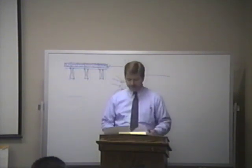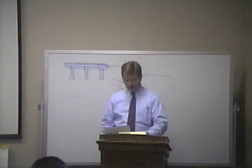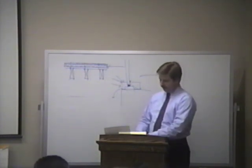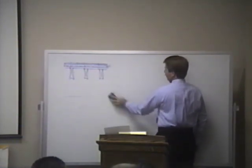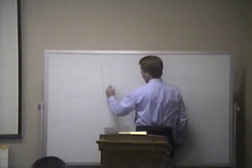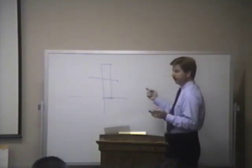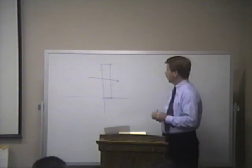Infiltration, next subject, and that's a big impact on houses. It's an impact on commercial. On page 79, it says a typical new building's infiltration comprises a range of about 10 to 20% of the total heating and cooling. And basically, I'll let Ed and Charlie deal with the technical aspect, but I don't care what your building's made out of, you'll get infiltration or transmission through a wall. Winds and various elements impact that, but through solid materials, wood siding, insulation, drywall. It's not as prevalent in concrete block because of the mass density, but you do have infiltration anywhere there's connections.